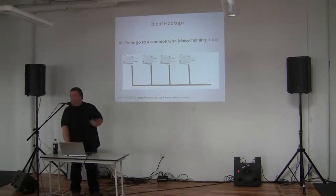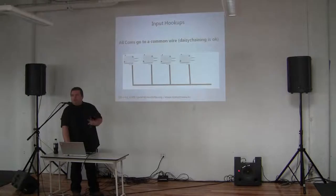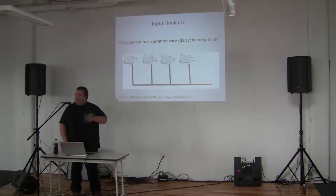All the ground circuitry you can just tie together in one big loop — that's fine. If half your control panel is not working, that's the first thing to look for. Check from the first button to the last button in the chain with a small meter. If you have a connection, your ground loop is okay. That's half your job. I resolder one wire and charge 50 euros.